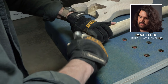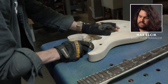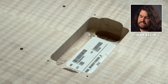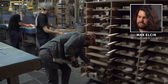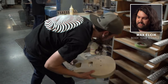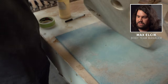Here we are watching him score the heel, and that is just so we get a nice mechanical bond as they build this guitar. He is going to score the heel and the inside of the neck pocket. A couple of different woods here — mahogany and maple — and they are going to react to glue differently, so you need to make sure that the glue can penetrate the maple and get a nice bond. Jack is putting his initials in just to make sure that he has credit for the guitar. It lets us have accountability for any quality issues, but it is also that point of pride for a job well done.